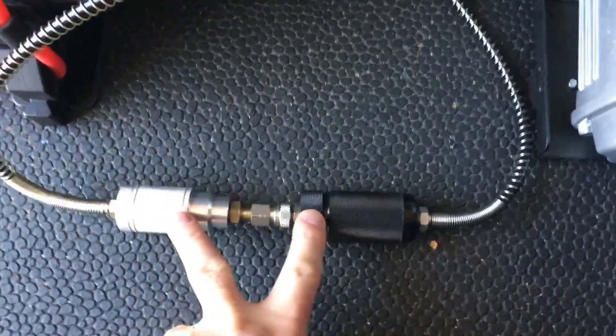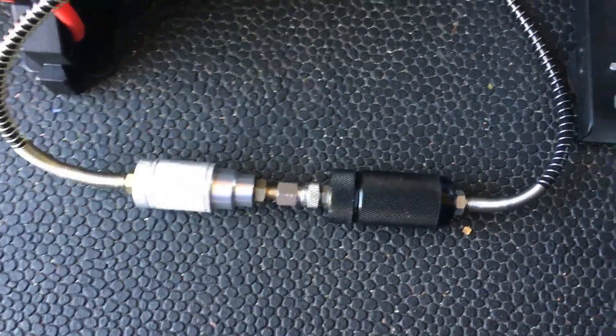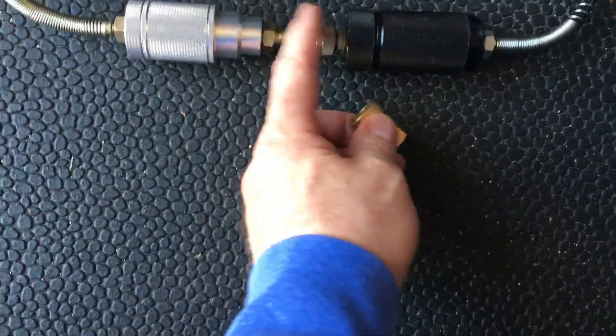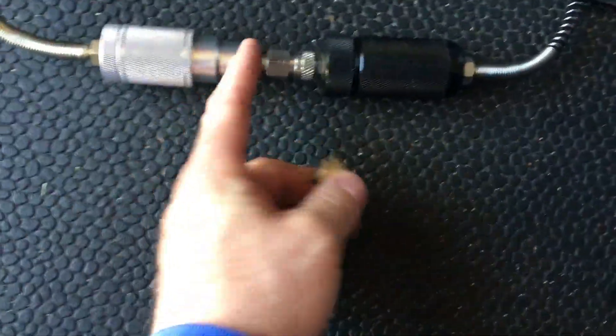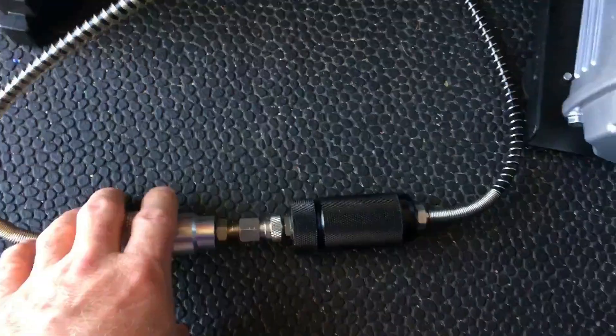My microphone wasn't plugged in so I'm doing a voiceover here. When I plugged everything in, I noticed these two were leaking at the connection - the interconnect between stage one and stage two filters. I had to disassemble stage two and replace the brass coupler with the silver one that's now mounted. It provided a much tighter coupling, and when I put things back together I was getting a seal and things were good.